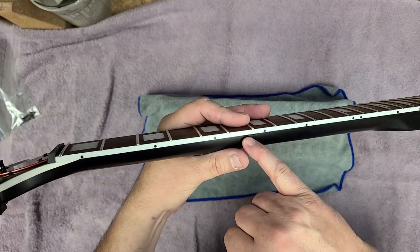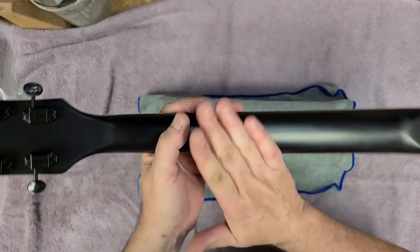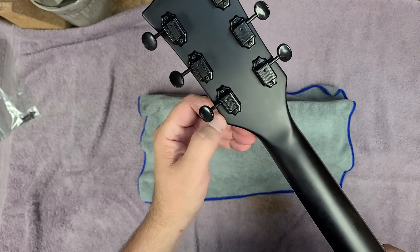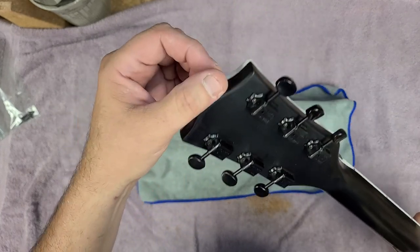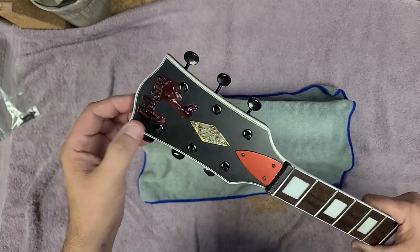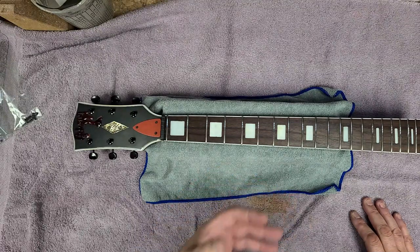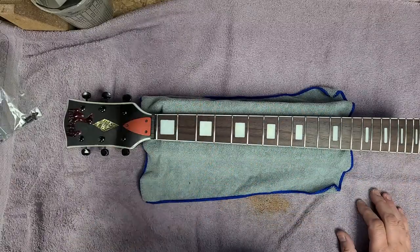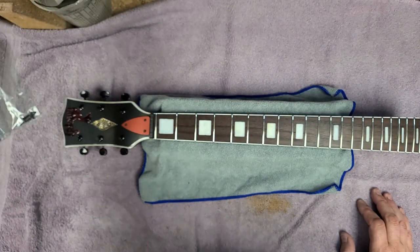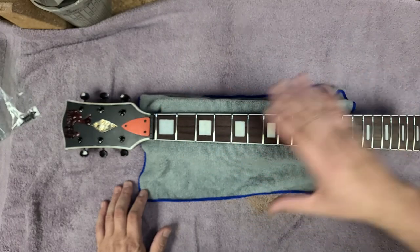It's really smooth. I did get some low spots near the binding that I didn't notice until after sanding, but there's not much I could have done about that. The downside of flat black is fingerprints get all over it. There was a hole on one side that has been completely filled, and damage on a couple corners that's been taken care of. The binding has been scraped so paint isn't on it. I put a clear coat over the paint and sanded it with 1500 grit sandpaper to give it a flat look. The fretboard has been conditioned with Feed-N-Wax — that stuff works really nice, love it. The frets have been leveled, crowned, and polished — it got the full treatment.